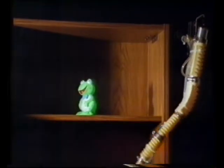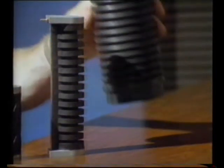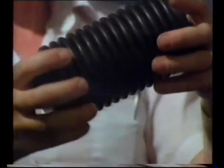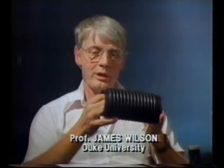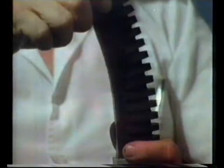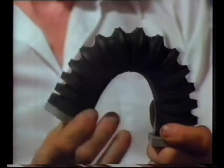The elephant's trunk was the inspiration for this compliant manipulator under development at Duke University. Imitating the muscle structure of the real thing needs some ingenuity. This is a bellows, and bellows operate in such a way that when they're pressurized they simply extend — the amount of extension depends on the amount of internal pressure. This behaves unlike a muscle that contracts; this expands. But this has a similar action if one considers reinforcing such a bellows along the side — you can get bending out of this, as when pressurized the element goes around in this fashion.